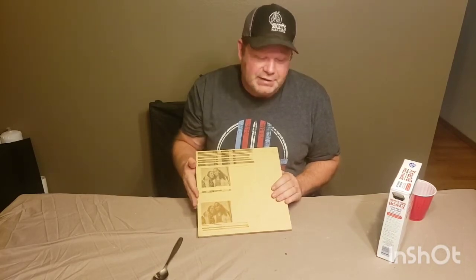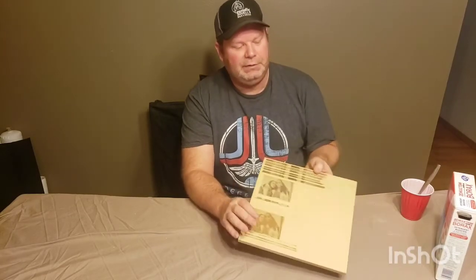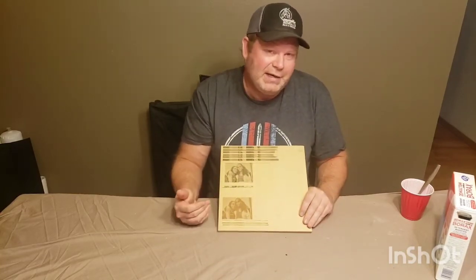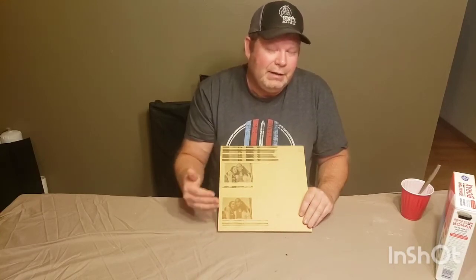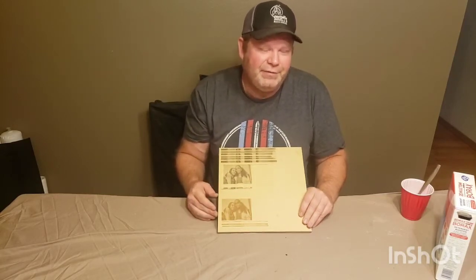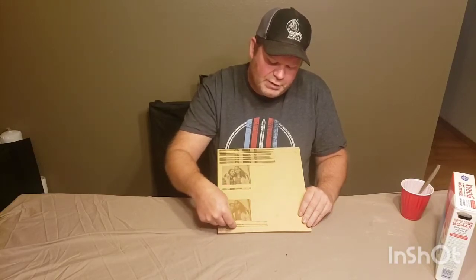Something else I'm doing different on this video: instead of using LightBurn I'm going to be using Laser GRBL — I'm not really too sure of the phonetics of how it's supposed to be pronounced. I'm pretty new to Laser GRBL, I've only done about three or four images with it. The reason I had to go to Laser GRBL is I got the new Ortur Laser Master 2 Pro and it works really great — I got one of the early pre-release models — but there's this glitch that happens where when it's doing images it'll slowly start to skew the image over and everything will start shifting over on the x-axis.